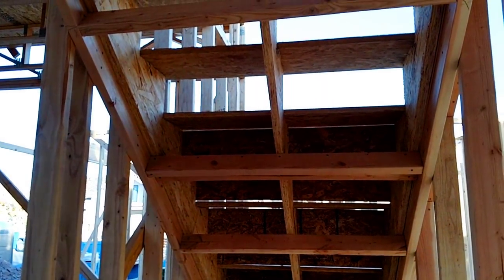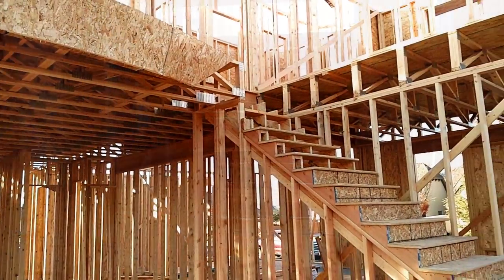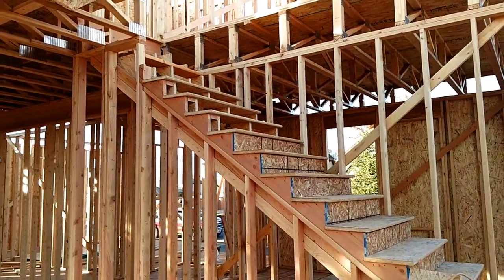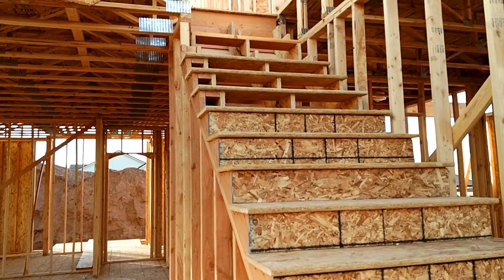You're going to want a riser about every foot and a half to two feet — no more than two feet. This staircase is about three feet from wall to wall, so we did three risers. If you do fewer, it's going to flex, and you don't want that. The only difference between a straight staircase and one with a landing is you have to treat it as two individual staircases, because the landing is 3/4-inch material and you'll have to compensate for that twice. I hope that all made some sense — building stairs can be complicated, but don't let it intimidate you. It's just math. Just do it — you'll be just fine.